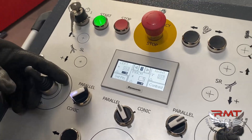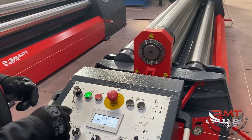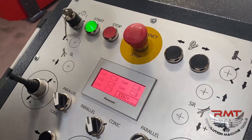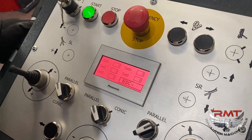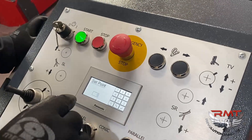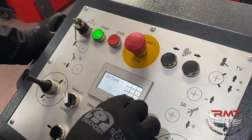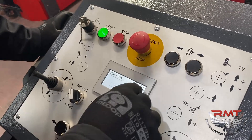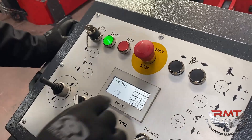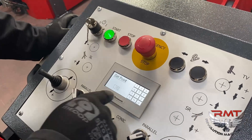Same thing for other rolls. This control unit also has some cool functions. You can set the set points here. Basically I got 10 gauge material today, and I know the pre-rolling positions. The first position is the straight position of the right roll, the second one is the gauging position, and the third one is pre-bending, which I have experience with before.